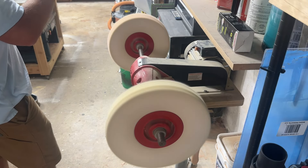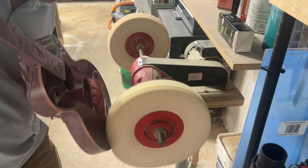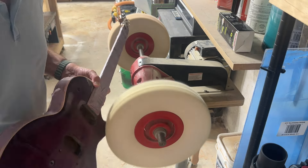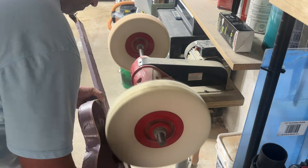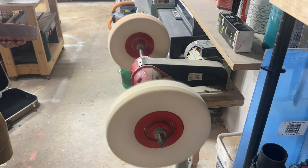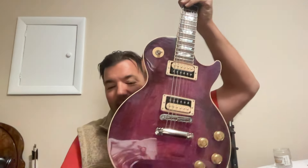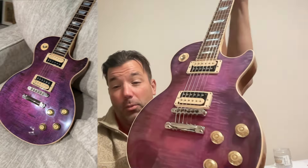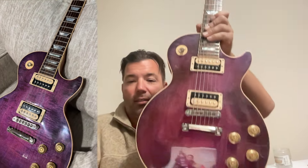Once it looks pretty good we flip to the other side - I think one compound was medium - and really get a nice polish on it. The trick with lacquer is letting it dry long enough so that as you're pushing on it it doesn't burn in. Keep the guitar body moving across the buffer and don't stay in one spot too long. Here's the final look - finally got this done, assembled it and got it all back together. Got to get a new control plate but it turned out really nice from where it was. These pictures don't do it justice but I'll splice in some victory shots. Hopefully we'll get some more videos going here shortly - thanks for watching and we'll see you in the next video.